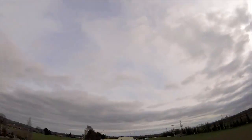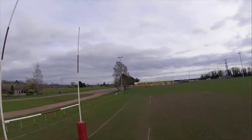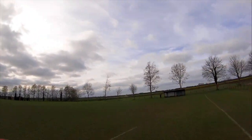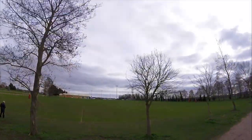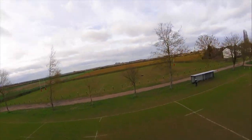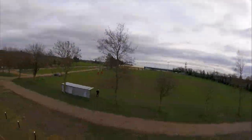The maiden flight is at the end of part one and the rates were way too low and I really couldn't get on with the supplied props. On this flight, a couple of days later, I replaced the props with Dal Prop Cyclones and increased the roll, pitch and yaw rates to 0.8, which made it much more responsive. There's some jerkiness and vibration that needs tuning out, but it's a good starting point and I generally like the extra power that these Sunny Sky Edge motors deliver. However, the original D Silver motors do have a smoother power delivery, which I really like. Enjoy the flight.